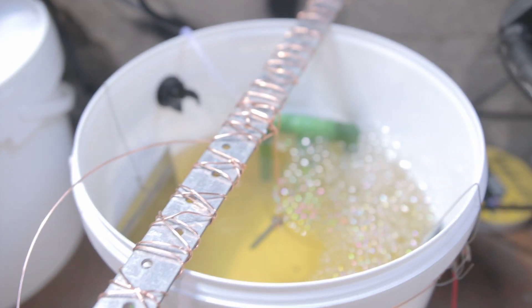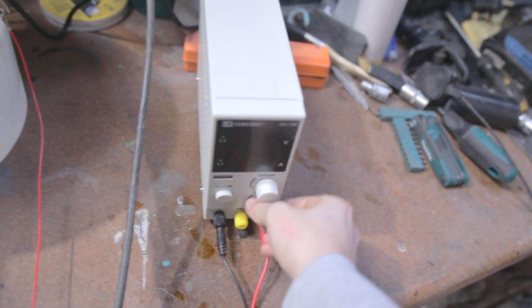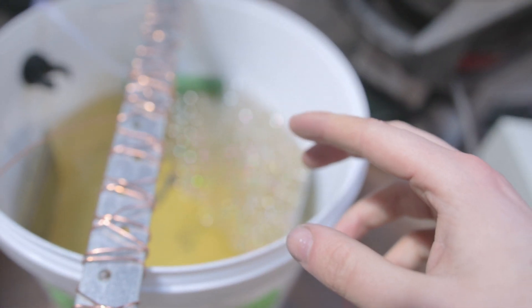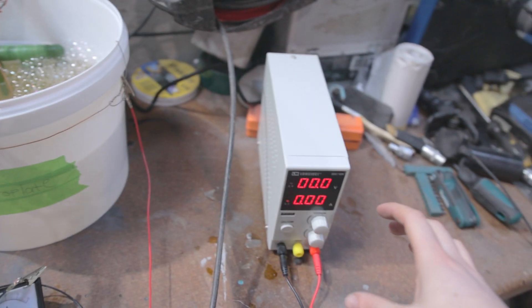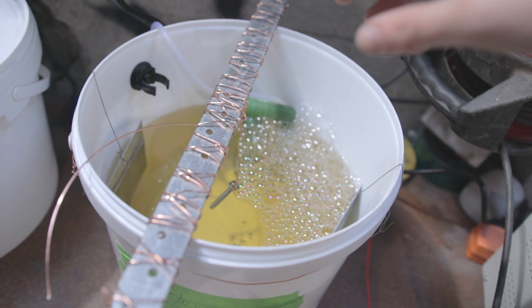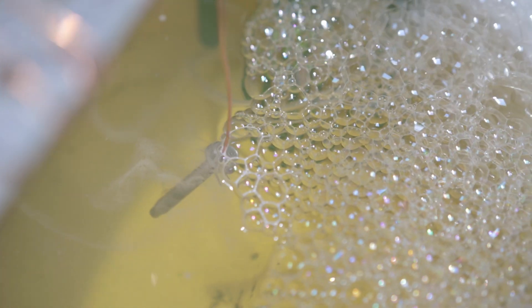The bolt is now sitting just below the top with the pump going. I'm going to turn it all down fully first, then turn the voltage up and mess with the amps. For how many amps - I figured out you can just keep turning the amps up until you start seeing fizzing on the bolt, then stop there. That's about where it needs to be. So I'll adjust the amps until I see fizzing, because that means the plating process is starting.